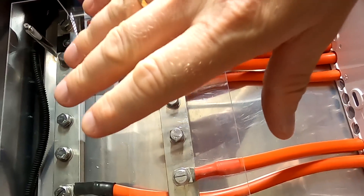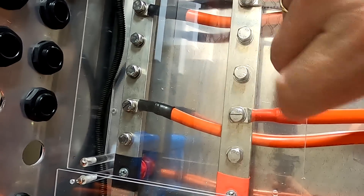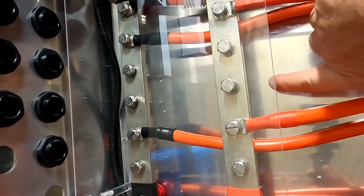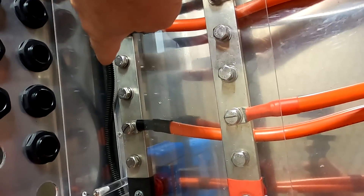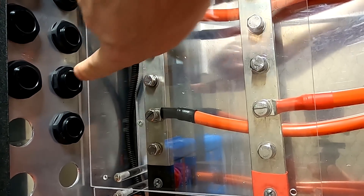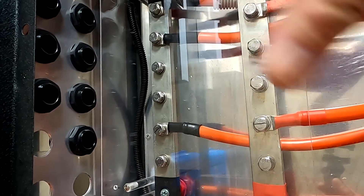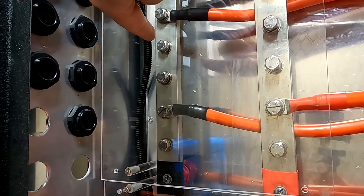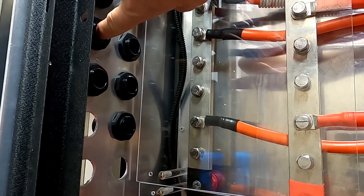People also want to know what decision I made regarding the bus bars and the connection of the negative cables, because there were three options. Option one was leaving the cover as-is and going underneath with the negative cable, connecting to the bus bar in a loop and using the glands as per my original idea. Option two was making a cutout and connecting the negative bus bar directly, using the top gland to come out in a nice bend.